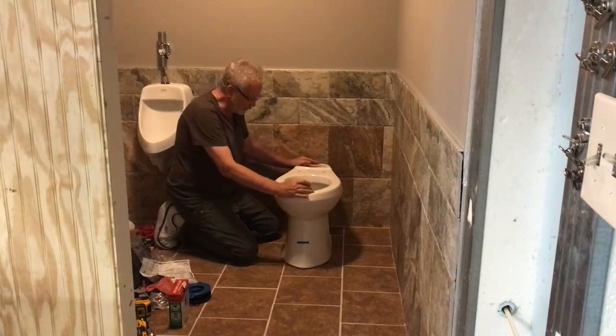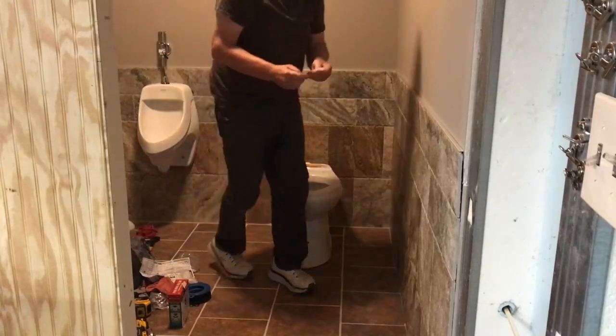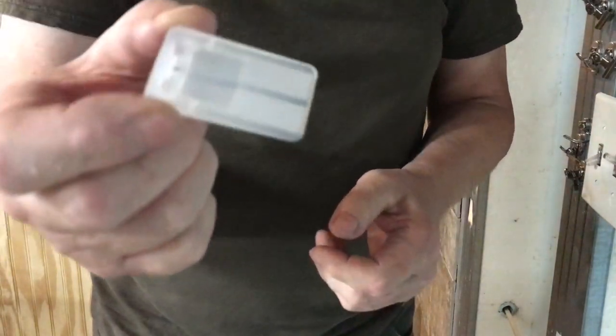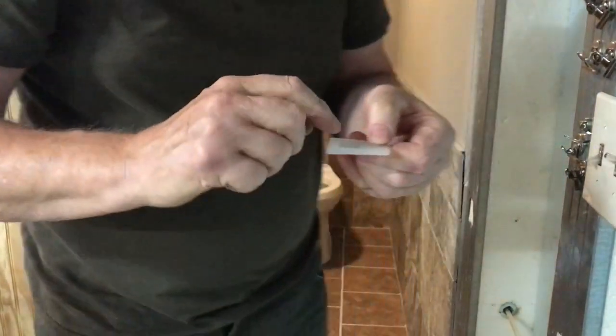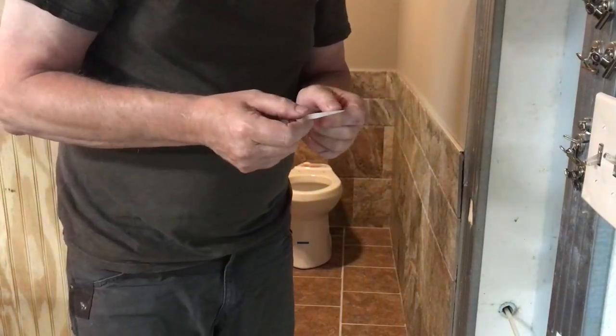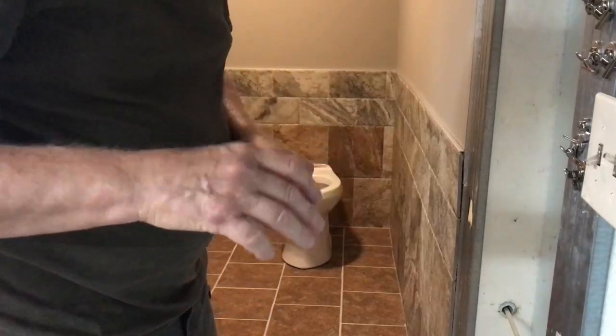So in this particular case, this is rocking. So what do we do? We're going to use what's called a commode shim. What is a commode shim? The commode shim is just basically a plastic spacer, and I will push it in to a point that it's tight on the commode. I'll mark it, cut it with my multi-tool, and then slide it back in again, and that'll take care of the rocking motion of the toilet.